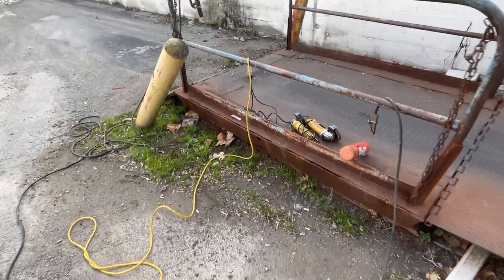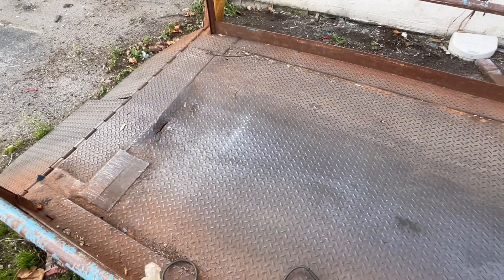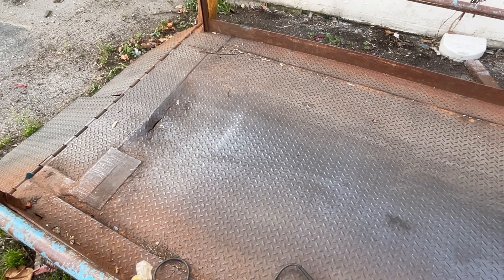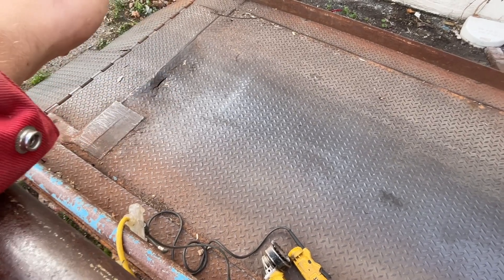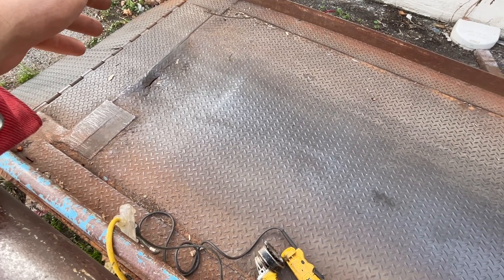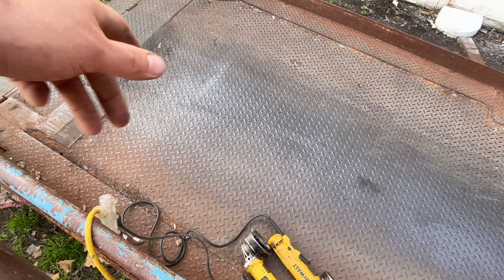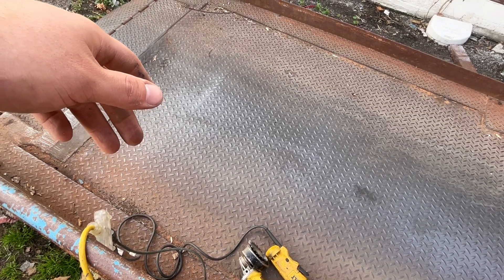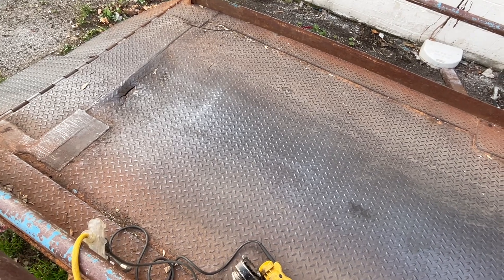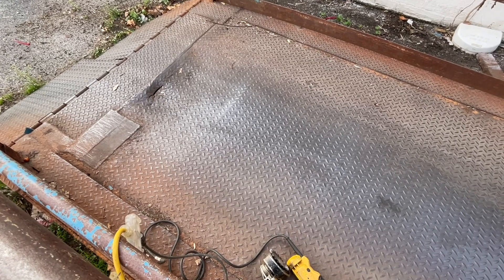This is a loading dock behind a grocery store. It's fairly old, been patched plenty of times before, and they're starting to get another hole right there. This is one of those times where they really need a new one, but we're just gonna scab another piece of patch plate on top of this. It'll last them another couple years, and then they can decide to either patch it again or replace it later on down the line. We're not gonna replace it right now.